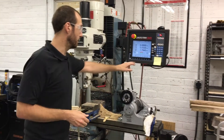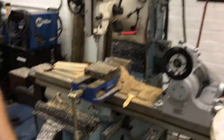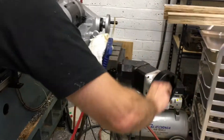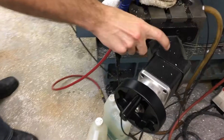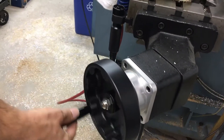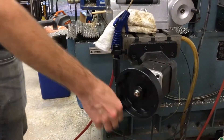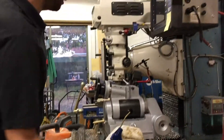These machines are CNC and manual, so they can be moved with a hand crank just like the traditional Bridgeport. This one happens to have the digital hand wheels on it that I added on later. So what you're moving is not the mechanical ball screw — it's an encoder. You have control over the speed of it in several different ranges.